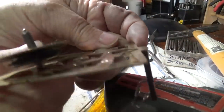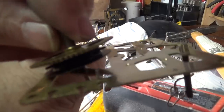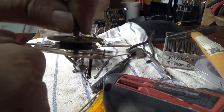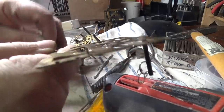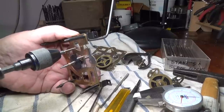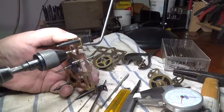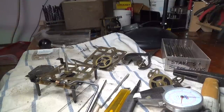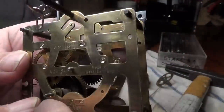All right, here's an example of when you have it apart, I can tell something needs rebushed. There shouldn't be any more deviation when you flop these around in there than 4 or 5 degrees. You see up and down, that one goes like crazy. Side to side, it's not bad, but it's worn this way. So we have to replace that bushing. Okay, we're going to ream this out to 3.47. Done. And now put the bushing in.